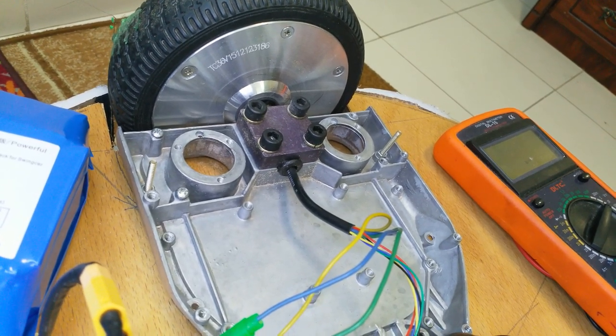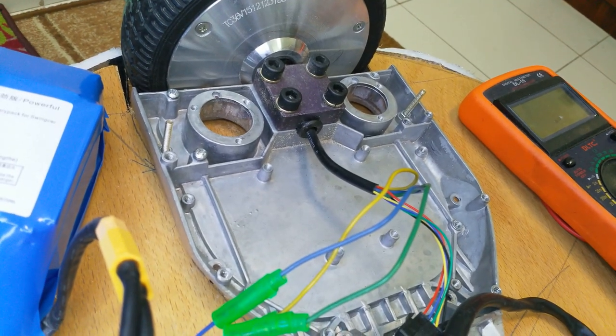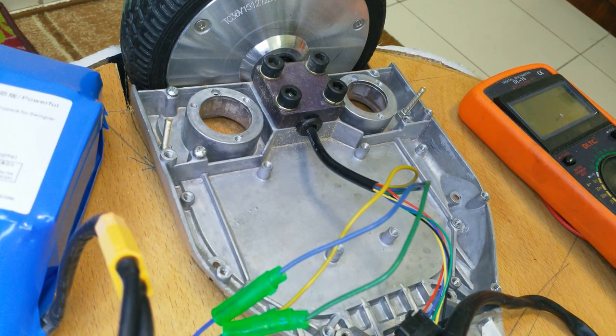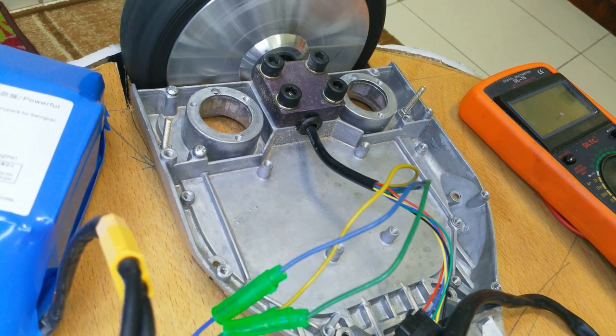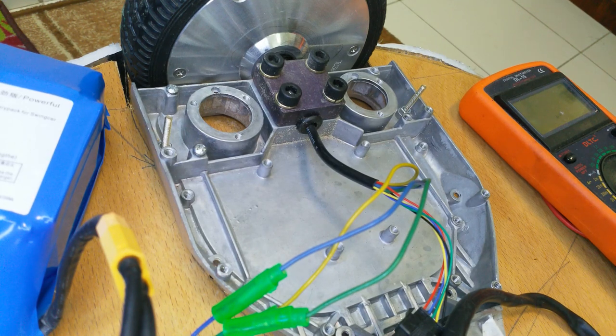One more thing I want to add: if you are using a potentiometer, use small cables, otherwise use shielded cables, because of the earth sometimes it is getting tripped. Then you need to reset again, remove the power supply and reconnect, then it will start.